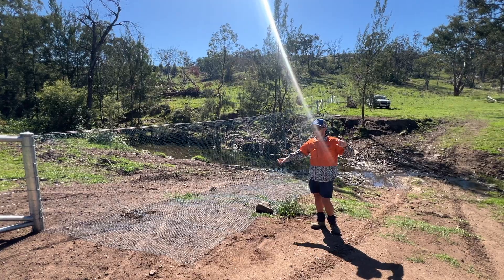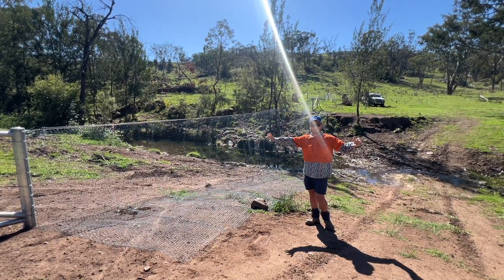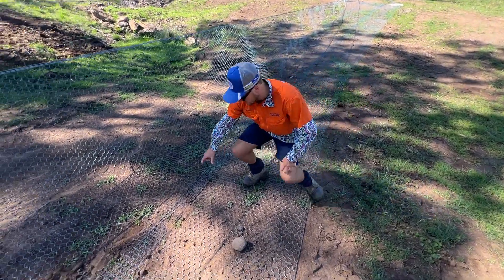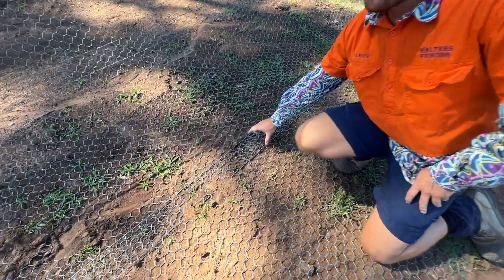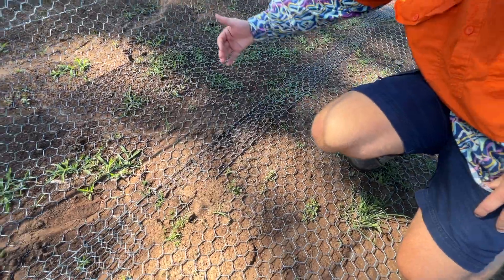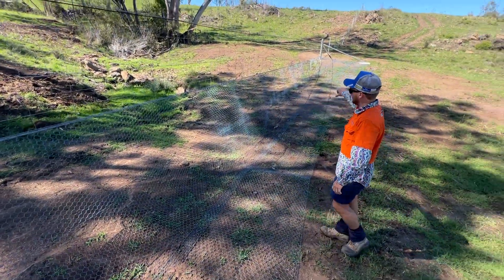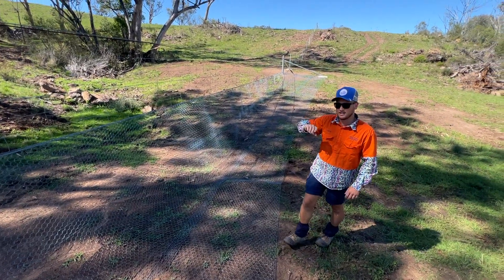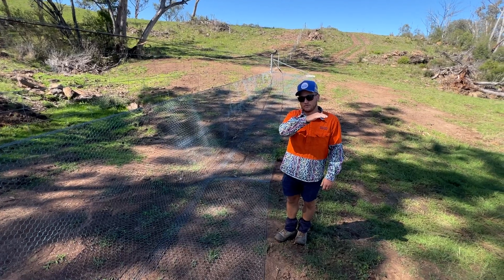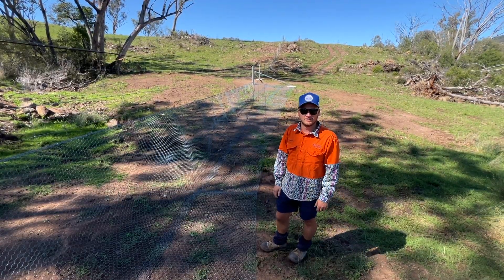This is another good way to do a gully — you can do the same sort of thing with rubber or the old ones with tin. We'll show how you can also do another gully that's shallower but longer. With the horizontal sheets we do it very similar — we just overlap them a little bit and pop as many clips as we can in to keep it strong, because once the flood rips through it's going to want to pull those apart. We clip them close spacings all the way across, so the idea is it'll just lift up with the flood.